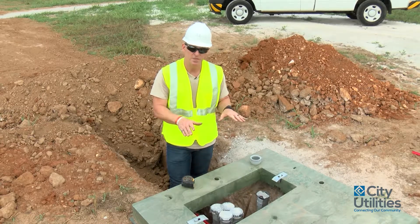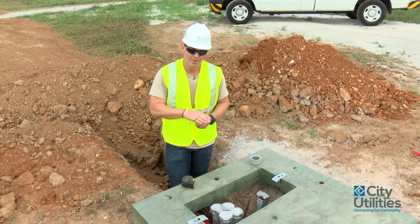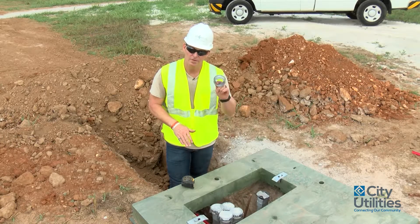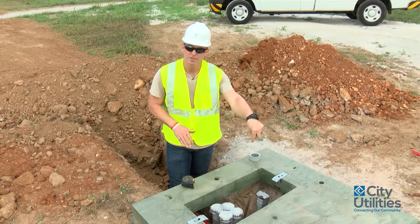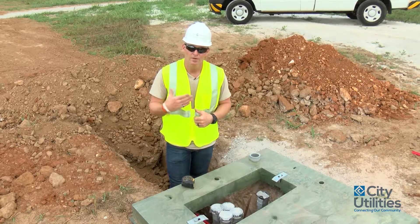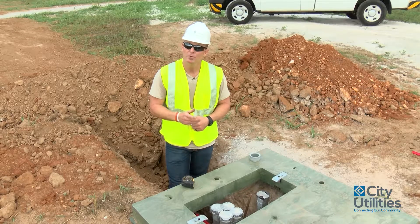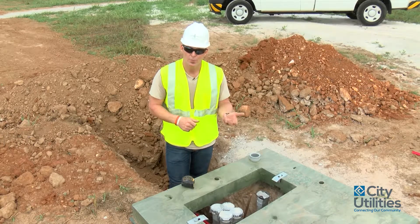When he calls me once everything is done, I'll come out to make sure the gravel has been installed properly, the pad is leveled, and bell fittings are installed. The end of the conduit will also have a string blown in while I'm present on site — or someone from our facilities has visually watched it being done — to ensure the string is in correctly for pulling in our cable or rope.